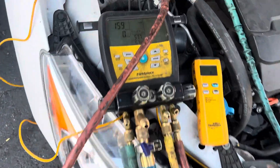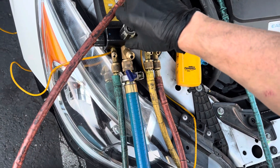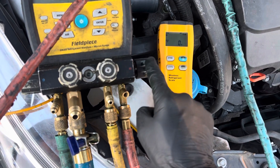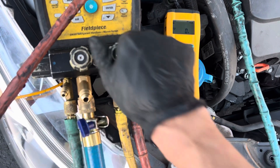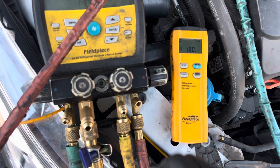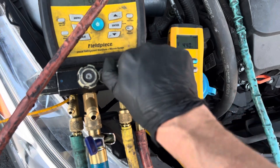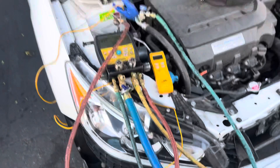So let's close off the vacuum — down to 159 microns. We'll close that off and we'll put 475 grams in it. Keep an eye on the grams, how much we go in. I'm about to turn it on: high side open, liquid going in, low side suction off. One, two, three — and there we go. We're going on 200... can we hit 300? 300 coming. Can we hit 400? Four coming. Let's start shutting it off because we're getting full fast — 550. Let's give it another notch. Good enough for government work, and that's all it takes.